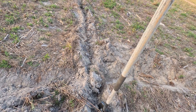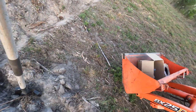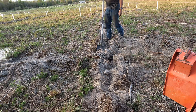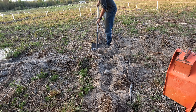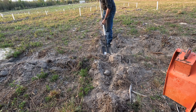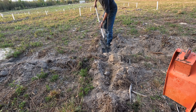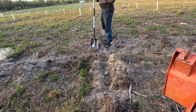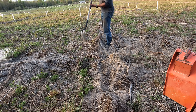The pipe isn't visible so I have to find it, but I need two hands so I'll put the camera down. I come over here and gently dig — I don't kick it down, I just gently push it down, putting all the dirt to one side. I went too hard on that one and felt the pipe. If you go too hard you can easily break it, so just gently go down. The ground is actually still wet down here about six inches. Now that the pipe is exposed, you've got to be real careful because this shovel will easily break the pipe.